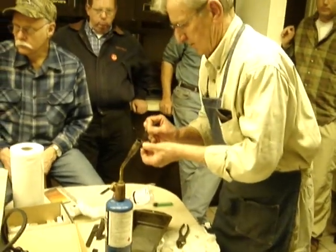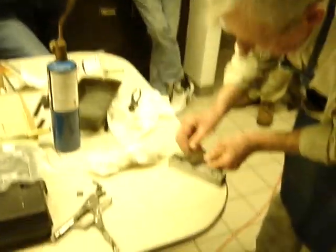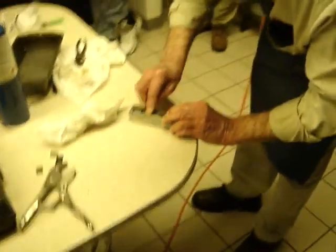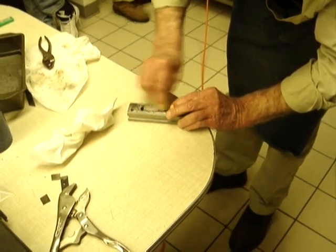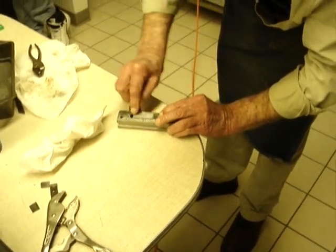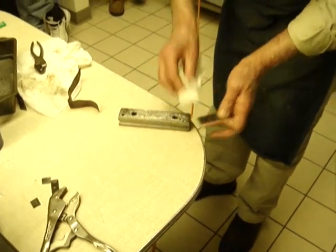So then the next step after you've heat treated your blade is, when it's in that high state of hardness like that, and Rockwell is the most commonly used measure of hardness. It's called Rockwell hardness. I would guesstimate that's got to be way over 62. I would put it somewhere in the range of 60 to 66, I'm guessing.